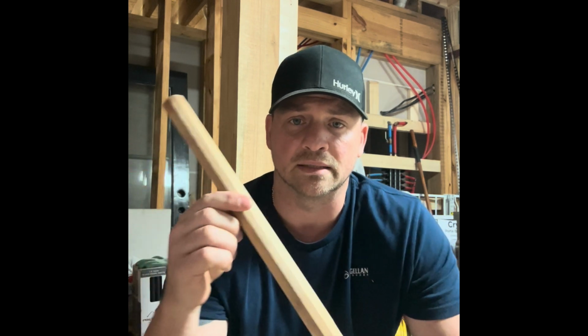So you just seen how I made the mortise, the tenon, and the dovetail pockets. During the recording of everything, we got into kind of a time crunch, and I had to stop recording and push a little further into the house so we could try to get into it before I actually got my beams put up. But the two things that I didn't get to record that I'm going to show you now is my 1 inch pegs that I made to run through the beam into the tenons, and they look like this.